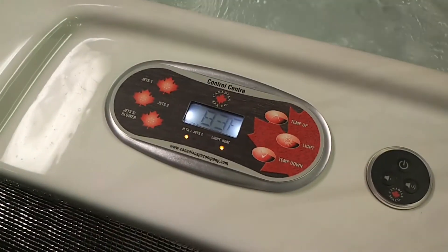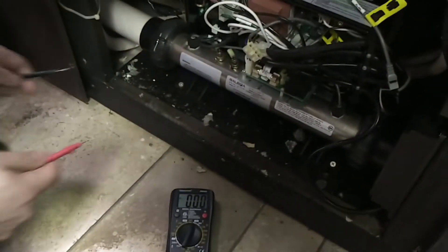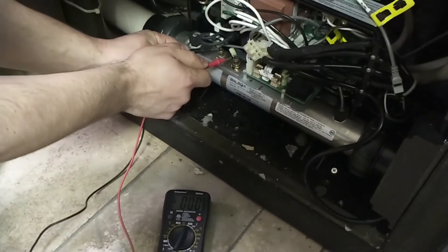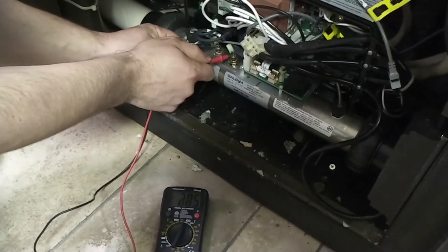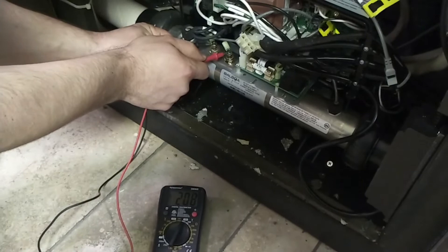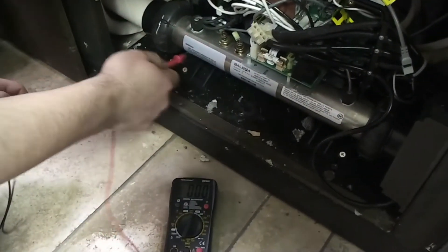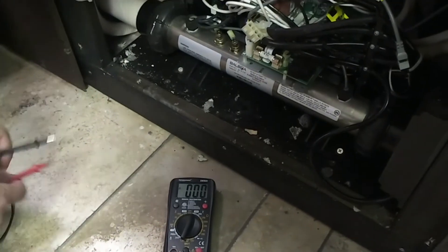Now we've got solid heat, so we can come down and check. Solid light — we can check the voltage across the heater. We're just going to check across two prongs here. As you see, I'm getting 208, 207. That's the correct reading I want right now. I've got voltage across this heater tube and that means the heater tube is running.